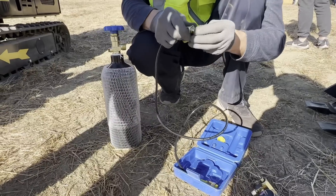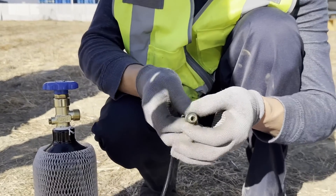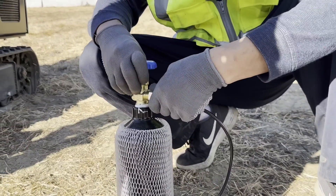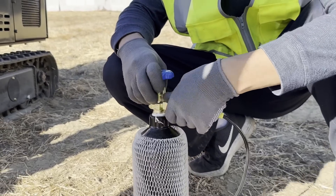Finally, let's talk about recharging the hammer nitrogen chamber. This maintains impact efficiency and reduces recoil. If you notice reduced percussive force or jerking hoses, it's time to recharge.